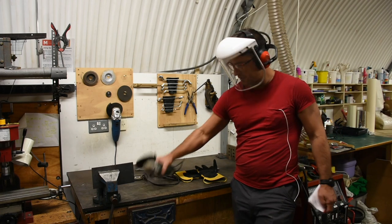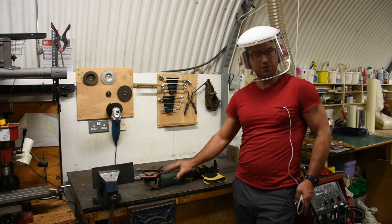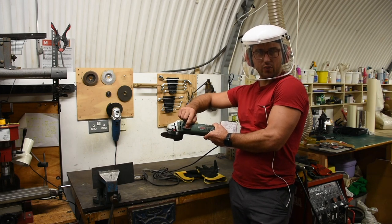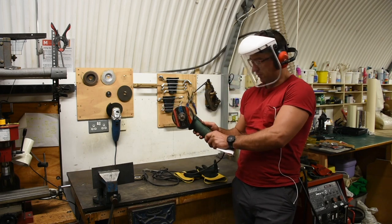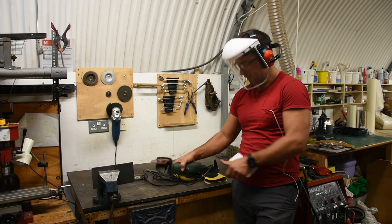Control of the tool is critical. This is small and spinning really fast with a bunch of torque. Do not set it down or take your hands off it until it is fully done spinning. Depending on the specific angle grinder, the lock will work in different ways — even across two models the lock works a little differently — so you can make a mistake and get it locked on. Make sure you know how to release it before using the tool.